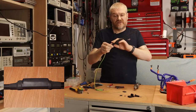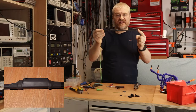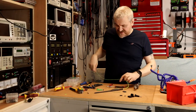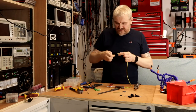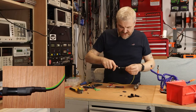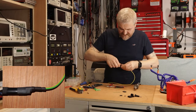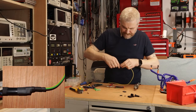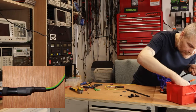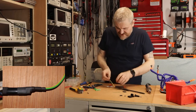By switching sizes and heat shrinking over joins you can make it quite neat in the end. I would have spent a little bit longer on it, but that's now covered. I'm just going to cover the end so it joins onto the wire itself just for neatness — using a piece that covers the silicon wire onto the end of the chopstick, and then finally a piece that just about fits over the end. One final piece on the end will get that as neat as it's going to be.